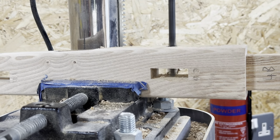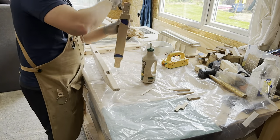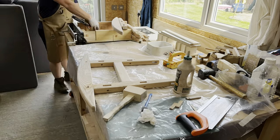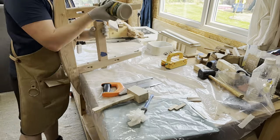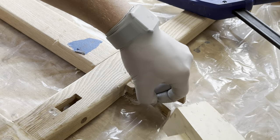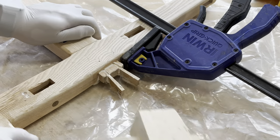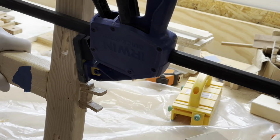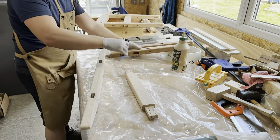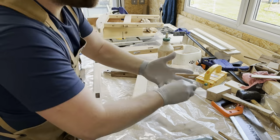Once I'd got all the holes drilled it was finally glue-up time. The first stage was adding glue to all the joints so I could get it loosely fit together. Once I'd done that I started working on the uprights connected to the base — I added a dowel pin, added a contrast wedge, and then started working on the wedged tenons on each side. You'll get a close-up view of me knocking them in. By this point the glue in the joint was nearly going off so it was a bit of a race against time. I repeated the process for the other side — this time it was more fluid because I'd had a practice go on the first side, so I didn't feel as stressed, though it still was stressful.